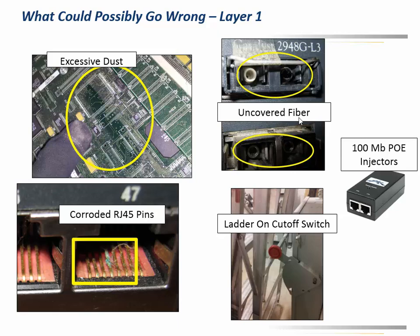Related to that, we've got uncovered fiber connectors or ports. This is a pet peeve, but it's a legitimate issue. If you have fiber connectors or ports, please make sure the little caps and covers are on there. If they haven't been on there for a while, please do not blow out the port with your mouth — you'll probably be putting all sorts of stuff in there. There are proper cleaning kits and tools for this. Get the right tools and instruction on how to do it.